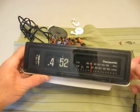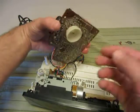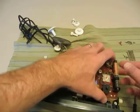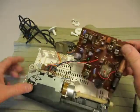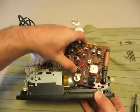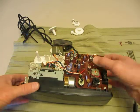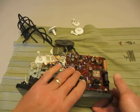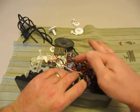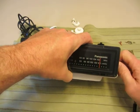To make sure your tuner is set, take it all the way over to the left. This is your tuner for the radio — turn it counterclockwise all the way, and that will put everything in place. Seating this is a bit of a trick, but if you take your time, it should fall into place fairly quickly. That big hole goes over top of this white post. Now I'm going to hold this down with my fingers, being careful not to push down any of the cans, transformers, or coils.